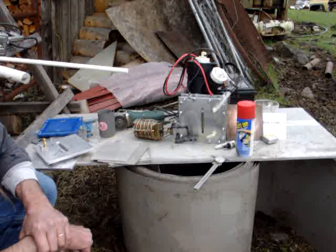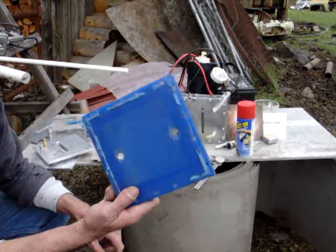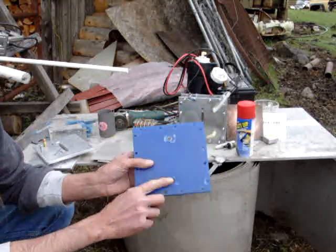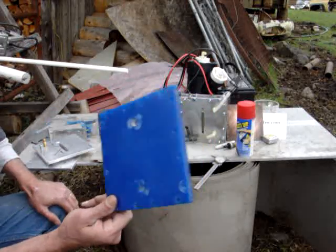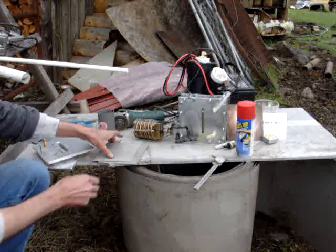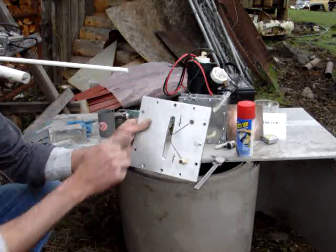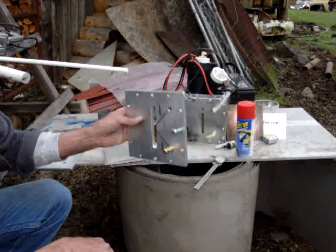So I decided to try a dry cell. The problem with dry cells is the end plates. This acrylic material is extremely hard to tap, and as you can see, with time, it's going to bend. Eventually, your cell's going to start leaking. That's garbage. What I came up with is this 7/16 of an inch aluminum. Threaded to 1/4 inch, threads nicely, and 5/16.